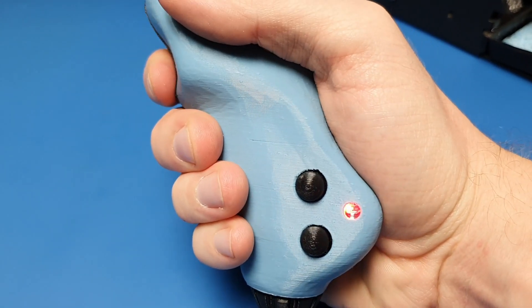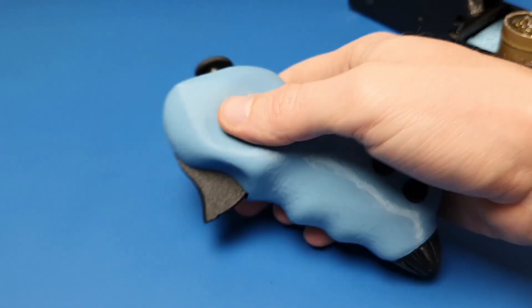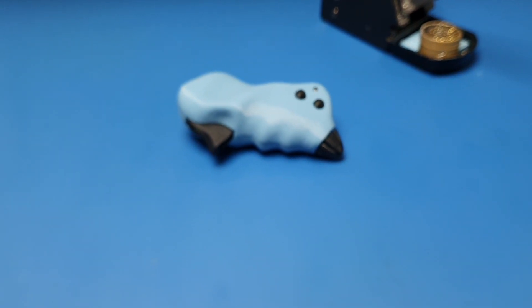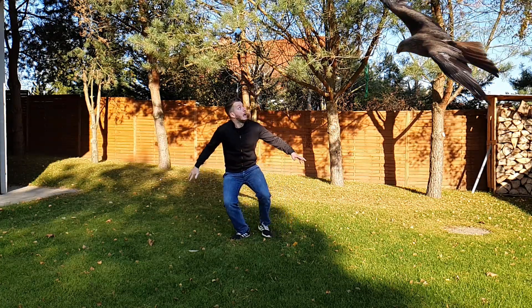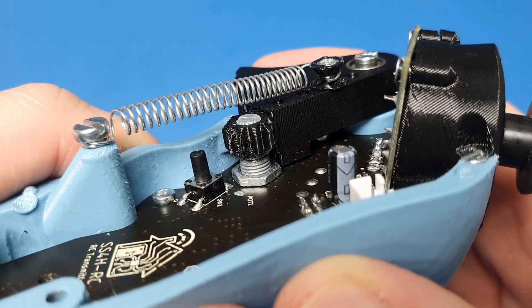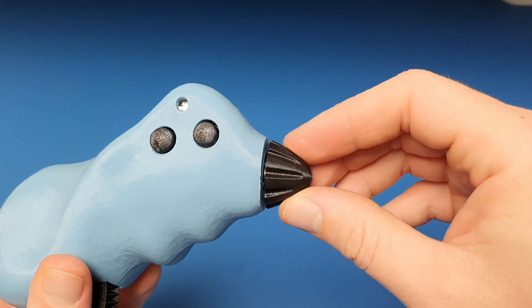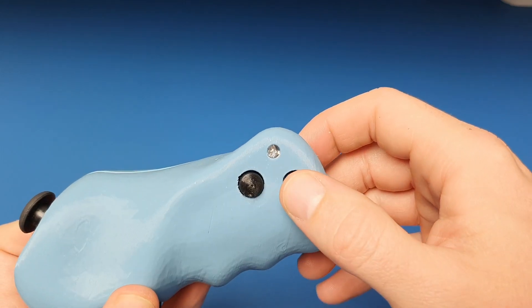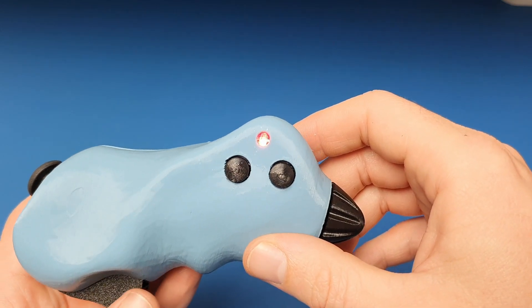The trigger — my greatest pride — has two functions. The first one is to turn the power on and off. When I release it, the power will be cut off and communication with the receiver will be interrupted. It's a safety feature: when the transmitter drops out of my hand for any reason, the receiver will stop the device immediately. The second function is to get information on how hard I press it — it's connected to a gear that turns a potentiometer and I'm going to use it as an accelerator. There is an additional knob at the bottom to set the maximum speed of the vehicle. I also put two buttons and an RGB LED in here for any use — their functions will depend on the receiver's device itself.